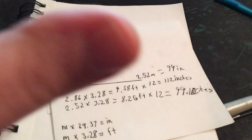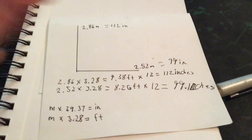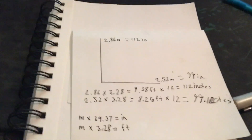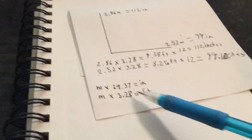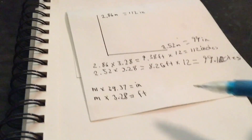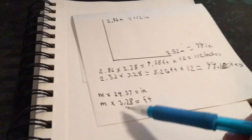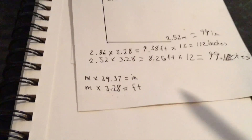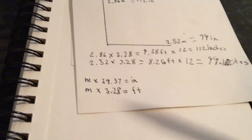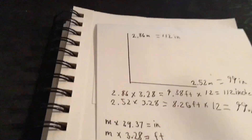An L-shaped dipole on the ground is going to be 211 inches — so it's not entirely what we're used to. The top portion is going to be 112 inches and the bottom will be 99 inches. It's easy to get these numbers if you can remember a conversion: to convert meters to inches, multiply by 39.37; to get feet from meters, multiply by 3.28. The way I remember 3.28 is 2π minus 3. Multiply by 12 inches to get from feet to inches. Either conversion works as long as you know one of them.